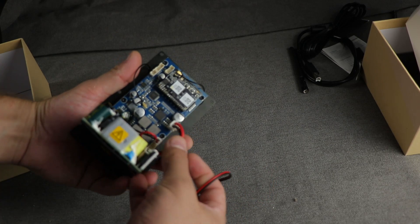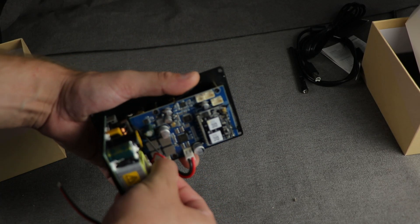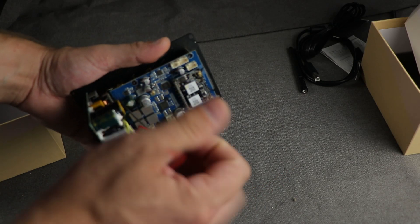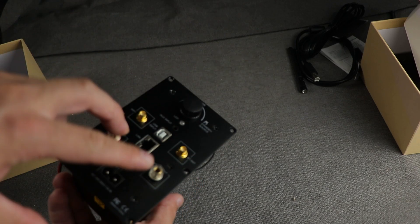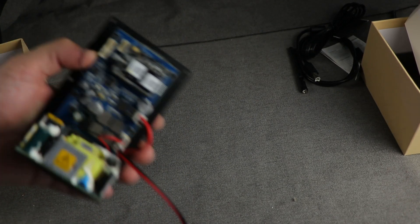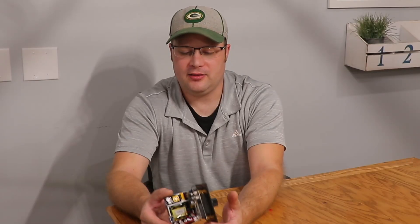Looking at the bottom right of the board, you'll see two JST terminals. One goes to the bookshelf speaker this would connect to. For a boombox where you want both speakers in the same cabinet, you remove the other JST terminal and either buy a new one or just cut the red and black wires and solder some on, since those connect to the binding posts on the back. It's really quick and easy to hook up two speakers in the same cabinet, and I really appreciate that.